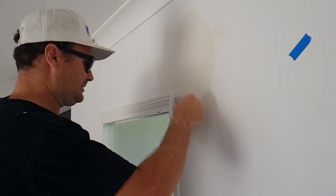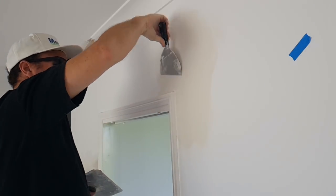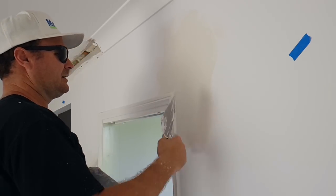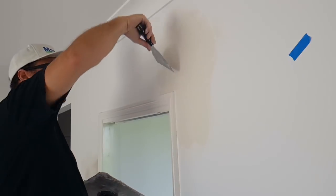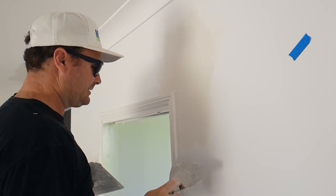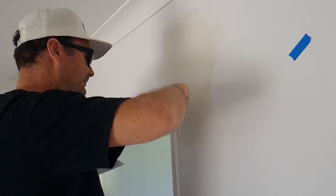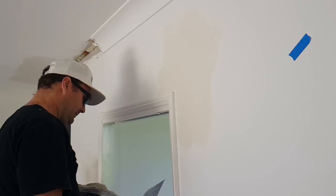I've got another patch here. I'll show you a good piece. It's been coated twice so we've had to take the tape through here, skimmed over the top. We'll put this second coat on and then between coats I like to scratch back up here. I don't sand - this face coat doesn't really sand. Make sure there's no dust and you're ready to put it on.